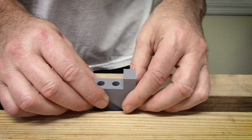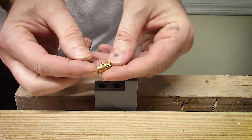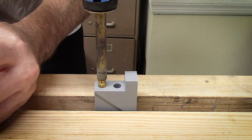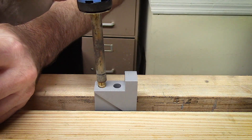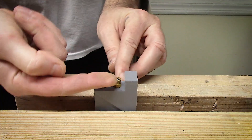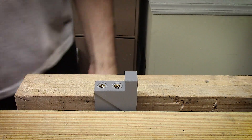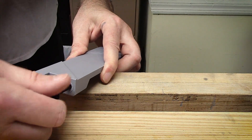I'm taking a quick look at installing heat-set brass inserts into our printed side stretchers. I purchased these inserts from Amazon — I'll have a link in the description. I'm using a soldering iron. The inserts do go in a specified direction. It takes a few moments to heat up the brass insert and then it melts right down in. When you're done setting the inserts, use a straight-edge razor blade and trim away any melted swelling around the area. You want to make sure the side arcs will bolt up nice and tight to these stretchers.